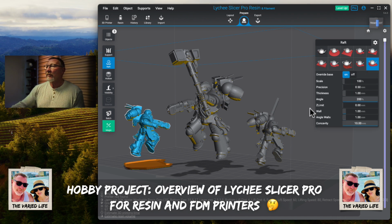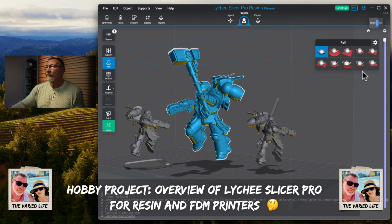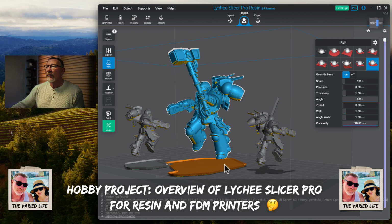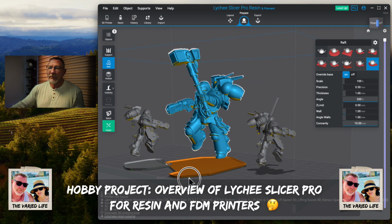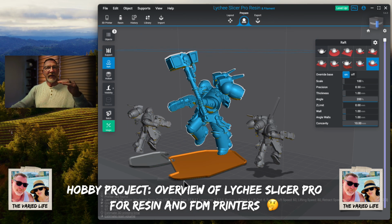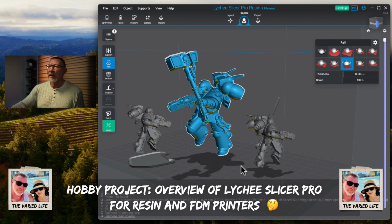What I found with this type of raft that has a little plate with a little lip on it, which is nice, so that way you can get your scraper tool underneath and pry the model off of the build plate, because it's going to stick there. It's going to have some force. But it's either this one, which I don't really like because it seems to use a lot more resin, than something like this one here, which is the line triangle.